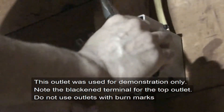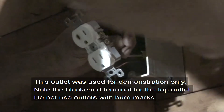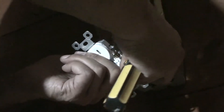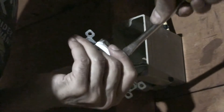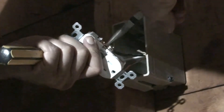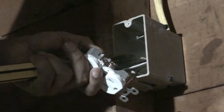Twist the wire in the direction you're going to tighten — in this case it's going to be tightened this way, so you twist the wire in the same direction as the tightening. Loosen it up enough to fit this wire around it, then push it snug. Usually loosen it as far as you can go and then use a pair of pliers to push it in place — needle nose pliers is what I recommend. That's now pushed in place, and then you tighten it down.